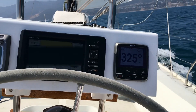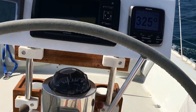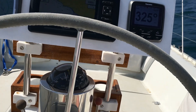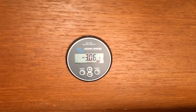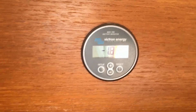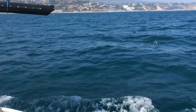On the leisure setting, even with hard over time set at 19, the boat's still controllable, although there's a little more action in the steering corrections than I think are necessary. And you can see the amperage spike every time the motor comes on, sometimes up to four amps, whereas it's usually under two on average.